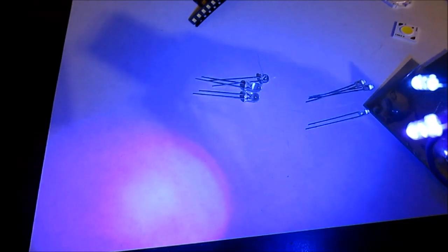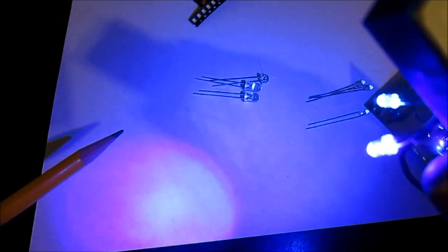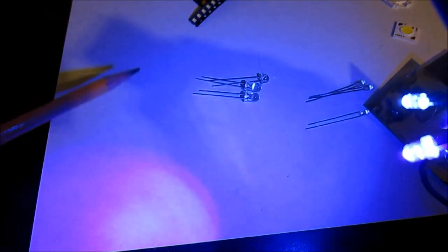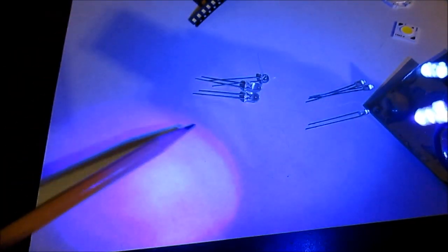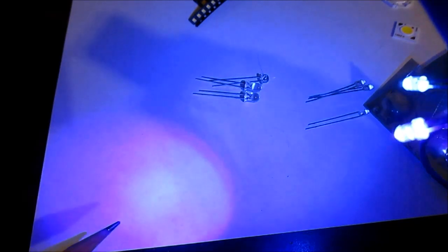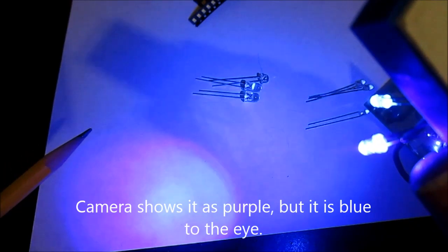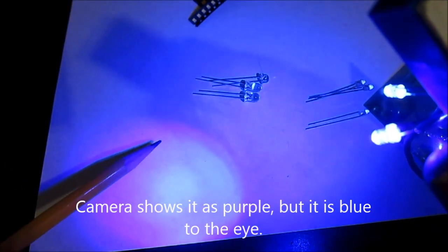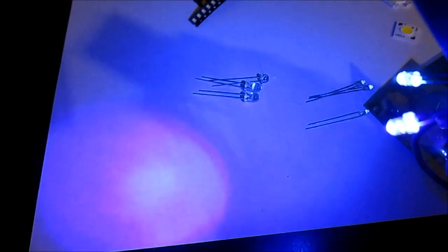Here's a comparison of the blue ones. The Optech has a big wide angle of light and the Chinese one is more focused, so it does seem brighter. In actuality they are similar in brightness. But the problem with the Chinese one is that in about a week it will get dim, whereas the Optech will last for a few thousand hours.